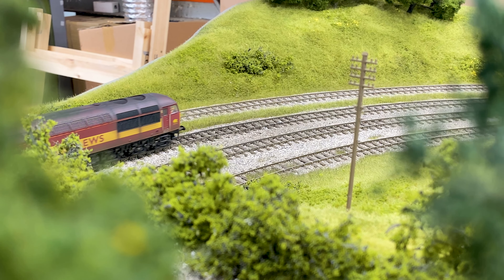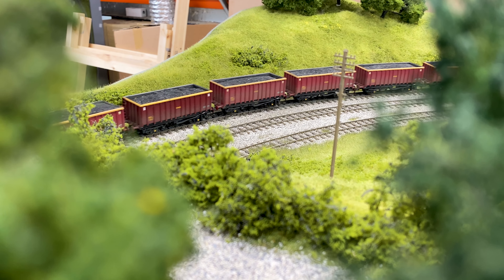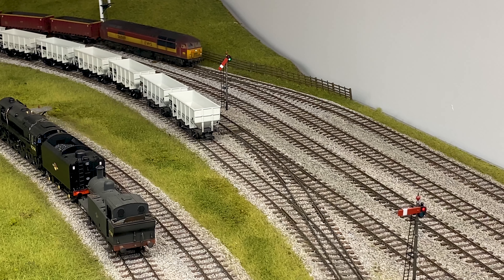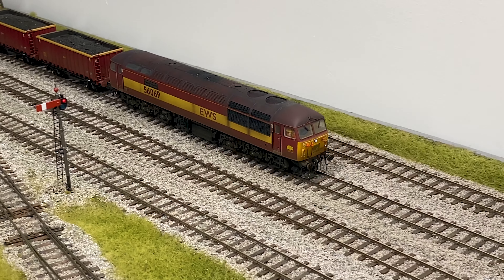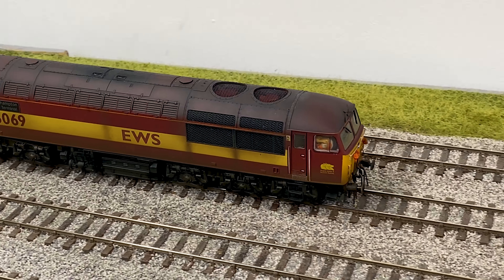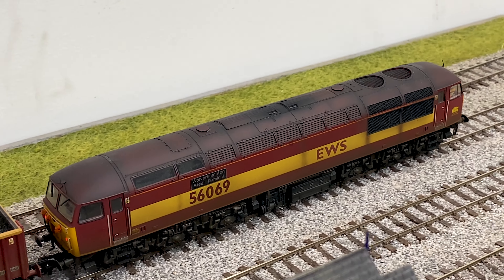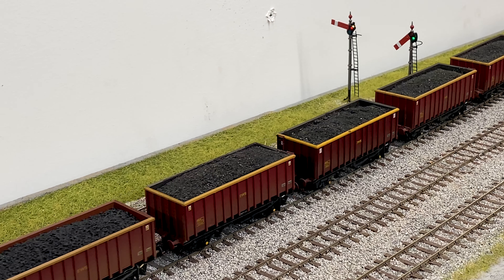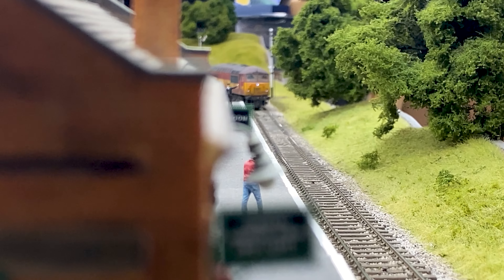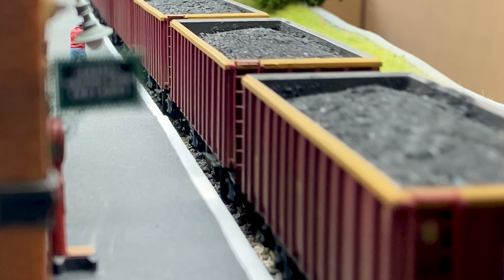Talking of the speakers, the pack also comes with various options in terms of the size of speaker enclosure you can use. It comes with a whole sprue of different size enclosures to go with the standard 15x11 cube speaker attached to the wires for the TXS decoders. In the Class 56 I've used the 40x20 largest enclosure available and I think it sounds very well, but I'm also starting to experiment with alternative speakers for the TXS sound. This video is very much about giving people a straight out-of-the-box guide using what Hornby supplies. To my ear it sounds really good as is, but with a different speaker — it needs to be an 8 ohm rated speaker at a maximum of 1 watt. I've already tried another type in a Class 66 and it brought out a lot more depth and tone, so I'll try the same with the Class 56 and share the results.